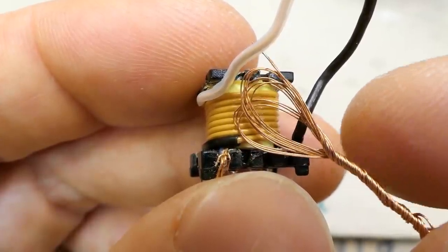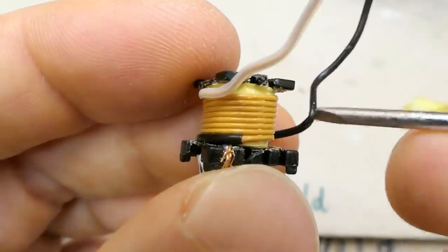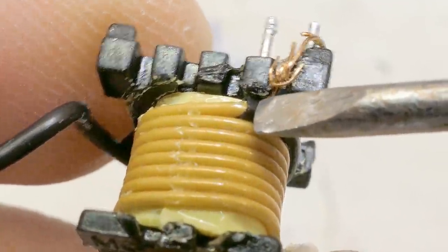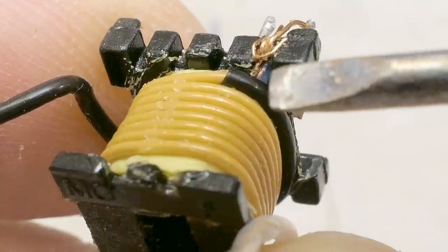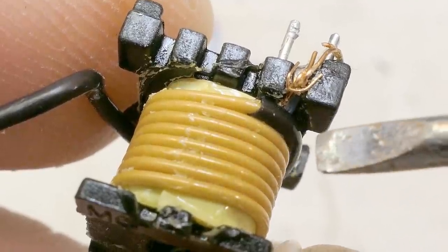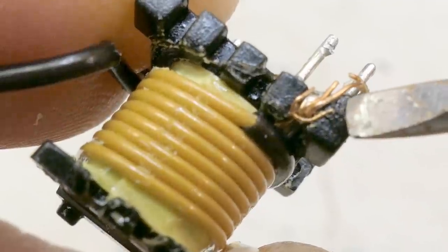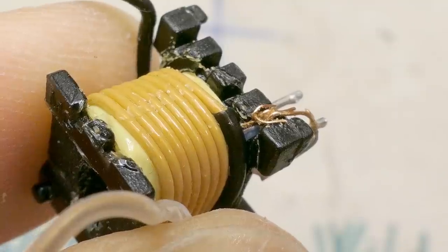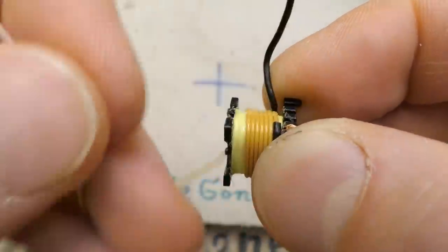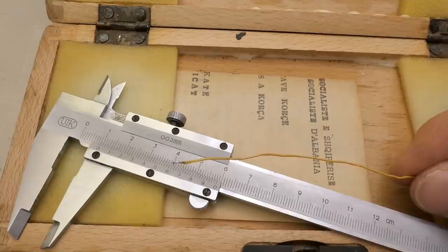The normal lacquer is probably 0.00-something millimeters thick. This safety insulation is definitely much thicker, and on top of that the ends have another insulation layer — a black insulation sleeve that extends all the way to where it's close to the auxiliary terminal, protecting it nicely. There is also another thick insulation layer on top. This thick yellow insulation is meant for safety, unlike the thin lacquer which is not intended as a safety insulation — the lacquer is not rated for applications where its failure can cause electric shock. This auxiliary terminal is therefore insulated from the secondary using two thick layers of insulation. Unwinding the secondary counts nine turns, and the ends have those additional sleeves.